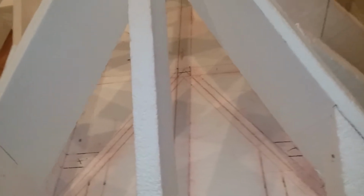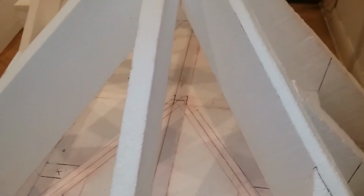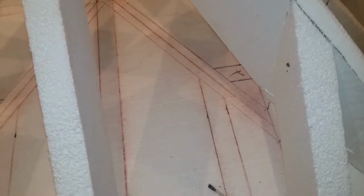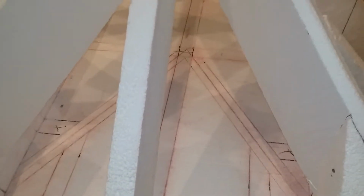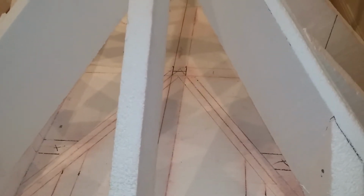So yeah. This down here, everybody, if you remember in part 1 or part 2, those lines down there represent the guts, the cellular level of the roof anatomy. They represent the hips, the king commons. You see? I even got some jacks marked out here. When you do a model like this and you put the lines at the bottom like I did on a base, a lot more things are going to make sense to you that you weren't able to understand for years, even if you've been framing for 30 years.